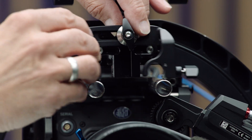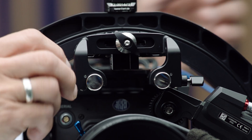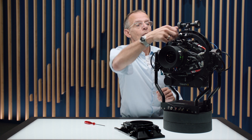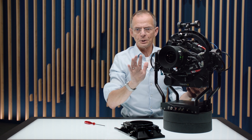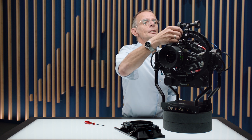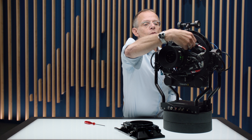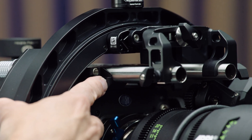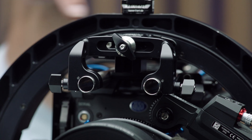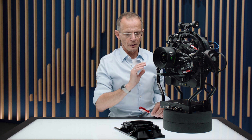Open up both clamps at the side and move them onto the rods. Once the camera is in its final position, lock all four wing nuts. If you need to do more adjustment later — hopefully not side to side, but maybe fore and aft — open the wing nuts before pushing the camera fore and aft or side to side, making sure all nuts are loose. Once you find the final position, make sure all wing nuts are fully tight. Also make sure the wing nuts holding the rods at the camera are tight on both sides, and that all four screws here and all screws at the camera are fully tight. Whatever is loose will produce vibration — especially high-frequency vibrations — so make sure all components are fully tight.